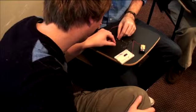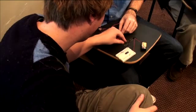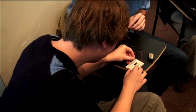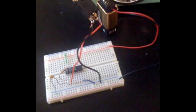Okay. So the first thing we need to do is provide power to our chip. That's already done on the boards that I gave you. You want to take these here, and orient the ground on the bottom. There we go. Okay, so you want it to look like this. Orient the ground on the bottom, and connect a resistor between the power and the power bus and the ground to the ground bus.